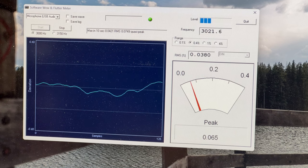All right folks, I think I figured out what's going on here. Problem is, I didn't remember enough of my basic electronics theory from back when I was a teenager. Basically what we have to do is convert the RMS voltage value, which is 549 millivolts, to the peak-to-peak value to expect on the scope. And when I do that calculation, I get 1.552 volts. So the deck was pretty close, and I've got it pretty much dialed in now, but I'll just show you here. I can't get it looking much better than this. The controls are really twitchy on this, but I'm happy.